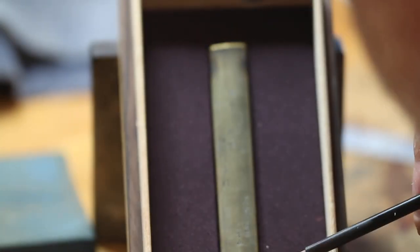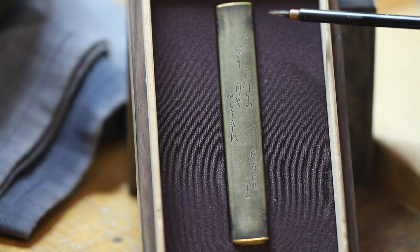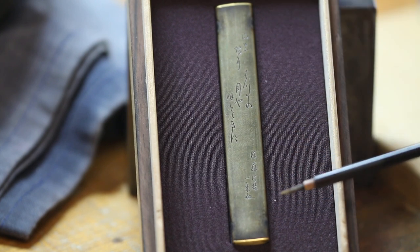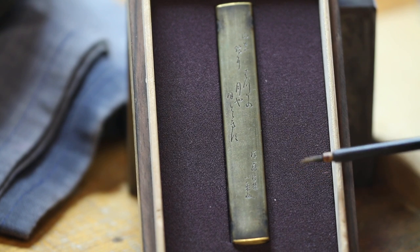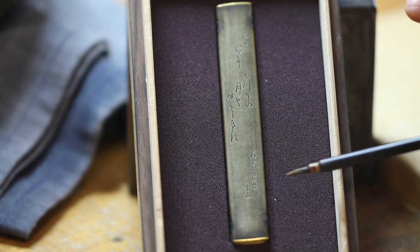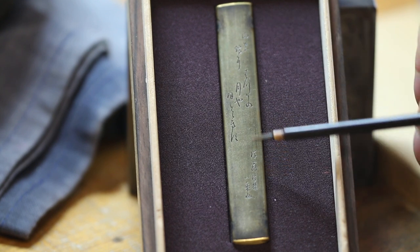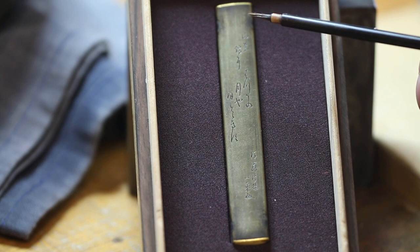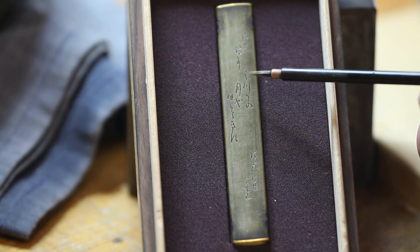This is the back of the Ichijo kozuka, and for me this is perfect. It doesn't look anything like it would have done when it was new. The patina — in the full sense of the word — has come about in a way I would be very loath to change or interfere with at all. The work I will do I will try to confine solely to the front to deal with those ugly blemishes. The back is something any sensitive connoisseur would want to preserve. What we have is the basic patina, which is a dove grey, now with a slightly greenish tinge — in my opinion due to silver chlorides which are yellowish and have formed over the years, giving the grey tone a touch of green or yellowishness.